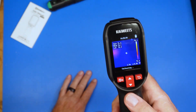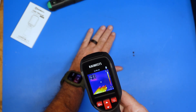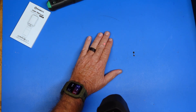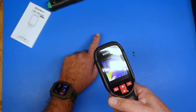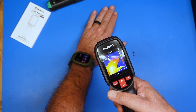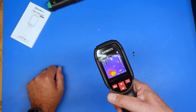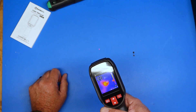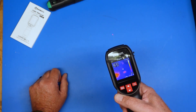When you look at the device, you'll see it has different markers on it. The laser is not going to show up on camera very well, but there's our aiming laser. We can get our ambient temperature where the laser is at — it's saying the center is 81 degrees, the high spot has been up to 87, and the low temperature is 72. If we move over here, the background is more like 71, the high spot is currently around 77 and dropping. As this cools, it will all end up being the same.